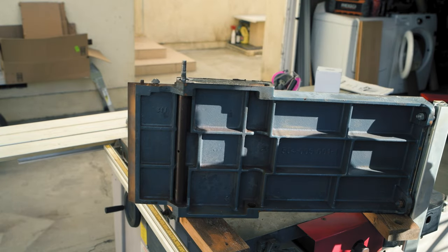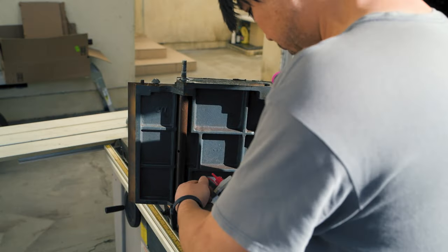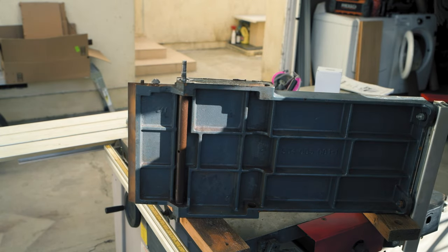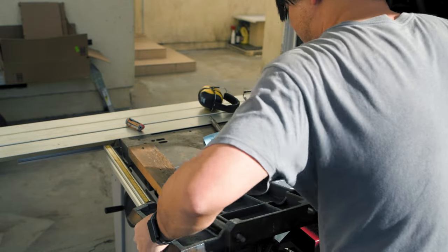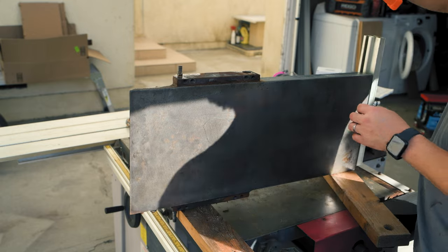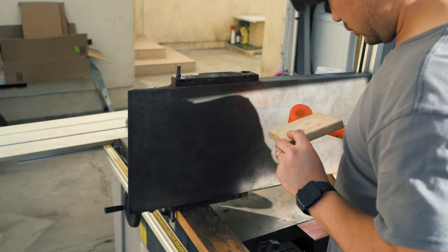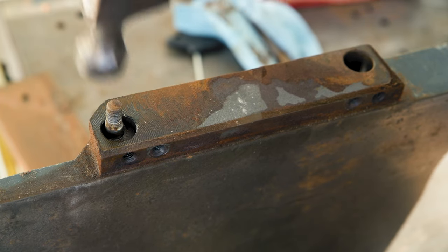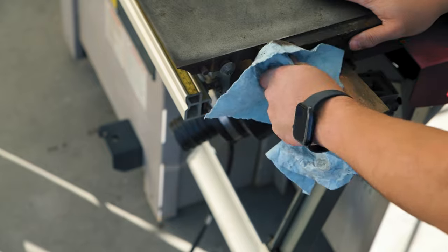I finally get the shaft to move a little, apply some 3-in-1 oil in the newly created recess, flip it around, and hammer more. Rinse and repeat. Then it comes to me, hey, maybe I've been using the wrong tool, or maybe it was the hammering and oiling taking effect. I can draft the shaft loose and pull it out completely.